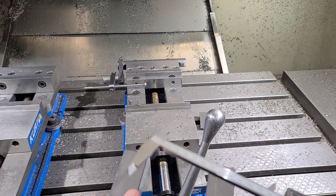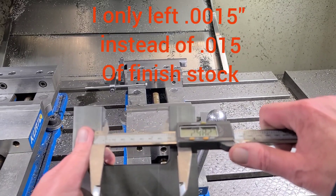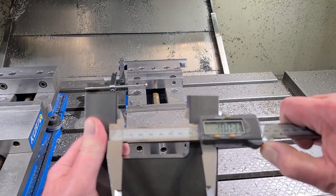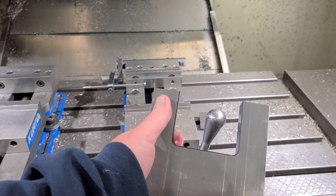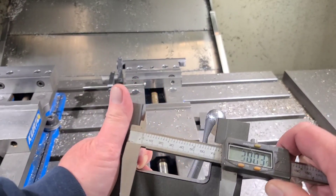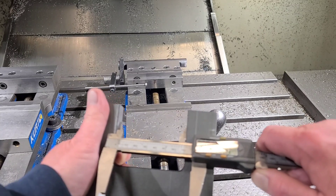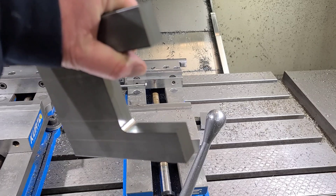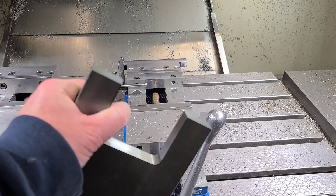This slot wasn't being influenced by the vise, so we should still have 15 thousandths on the 3-inch slot — but we don't. We've got 3 inches. On the slot, I was supposed to leave 15 thousandths per side, but it appears I've left only 1.5 thousandths because we're right on the number. I just looked at my program and we're right there — basically a thou and a half. So this is actually finished on the inside. The problem now is we've got to deal with the outside. I'm going to throw it back in the vise and check the flatness — it's moving around between 3 and 7 thousandths, which is not too bad.